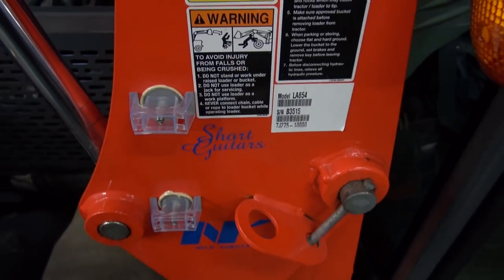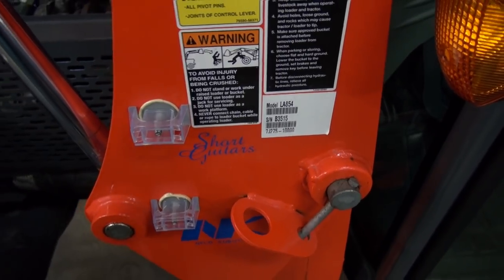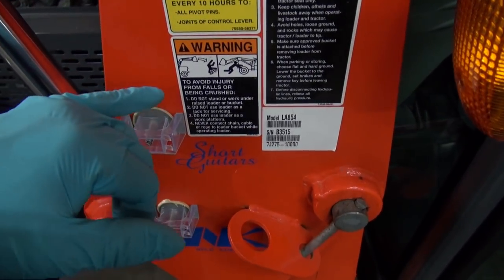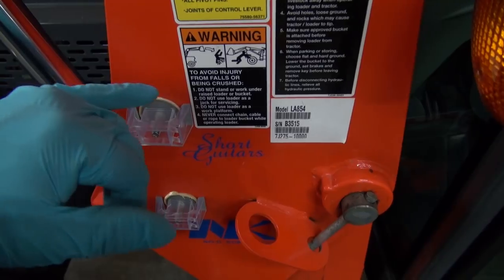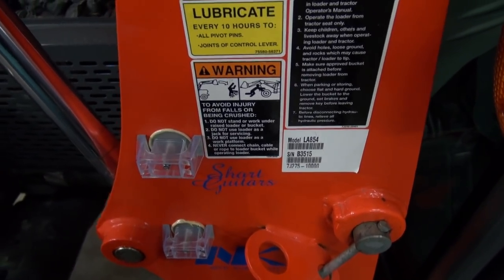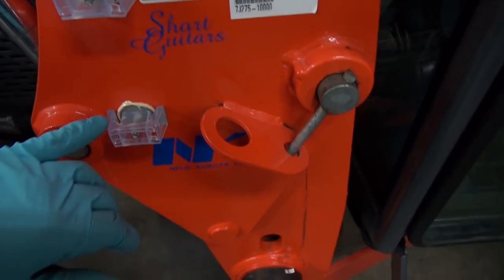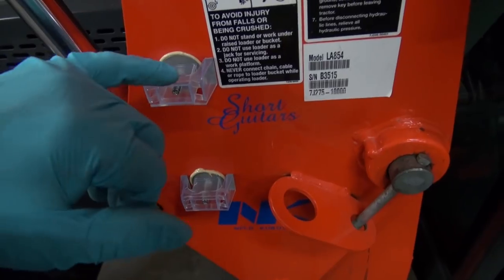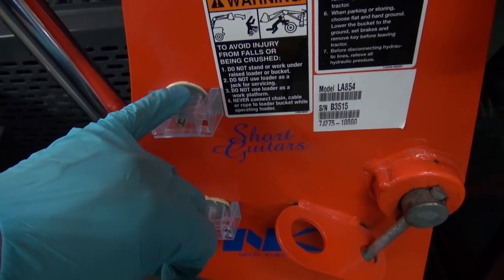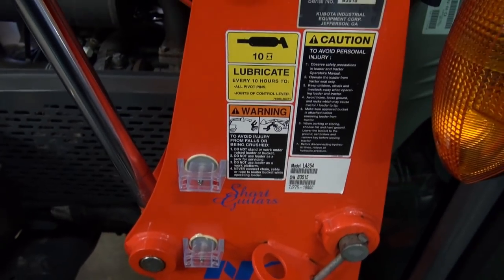And I'm telling you, it's got some hold. Now, if you wanted to really ensure that you had something really heavy, you would literally take this down to the bare metal, and of course then it won't tear away from the bare metal. Aircraft is kept together with this click bond material. And all of these studs and the pad is all stainless steel too, guys, so it's a really good system. I've used it in other places on the tractor as well.